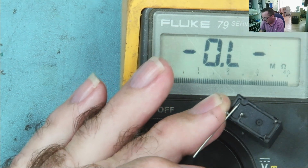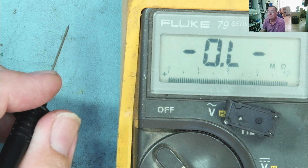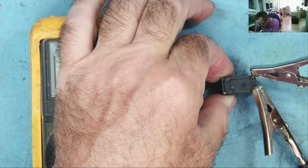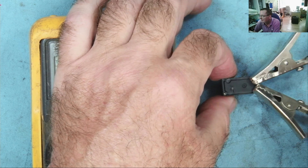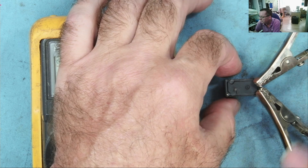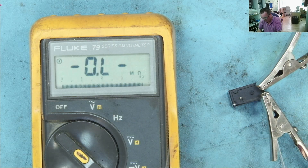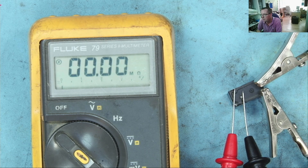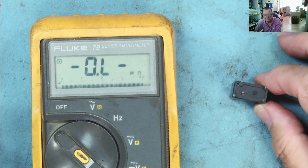The contacts show normally open - no contact between them. I need to check this relay is good, so let's use the bench power supply to put 12 volts on it and see if it switches. I'll switch it on - it's set to 12 volts. You can hear the relay switch clearly. Now let's check if the contacts have closed with power on - yes they have, reads zero ohms. I can't see inside this one but it does switch, so it is a good relay.